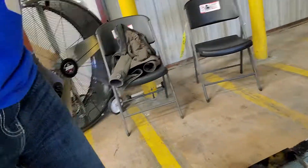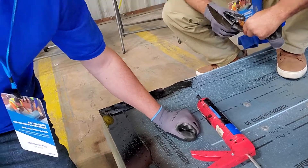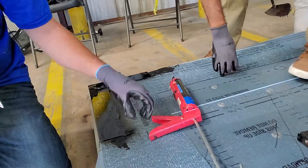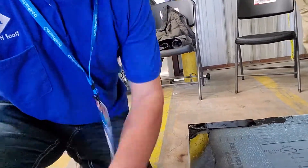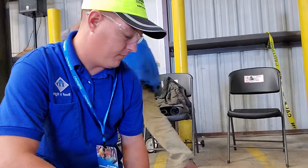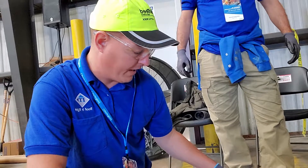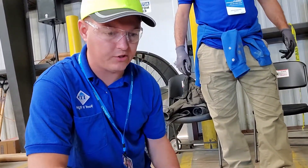So we're putting down our base layer, our nail-down layer, and installing a drip edge. On the drip edge, we put a self-adhering 9-inch strip around the perimeter. That is put down with a 70-pound roller to make sure we get full adhesion and there are no air pockets underneath this 9-inch strip. On top of that, we are putting a Certainteed adhesive — they call it adhesive but it's like a tar — so the self-adhesive tar around the perimeter edge. We're putting that down underneath so that it fully adheres under the drip edge. You want a little bit coming out around the edge, but not too much or it'll make a mess.